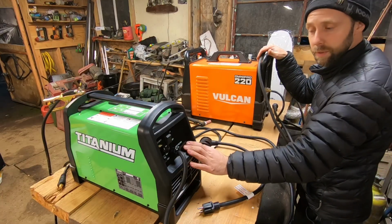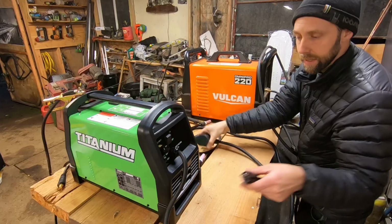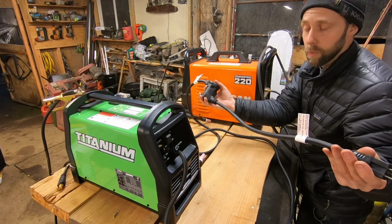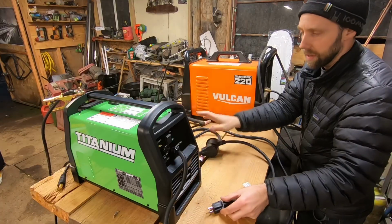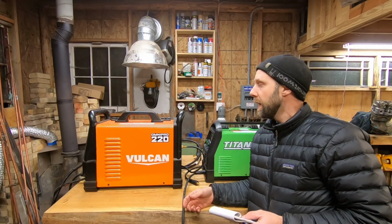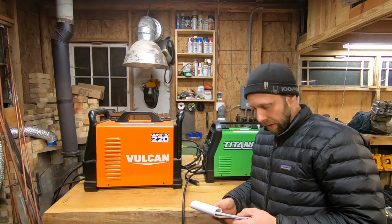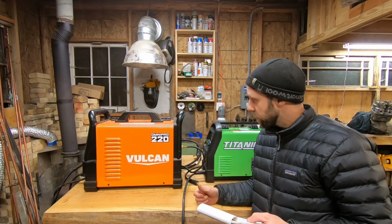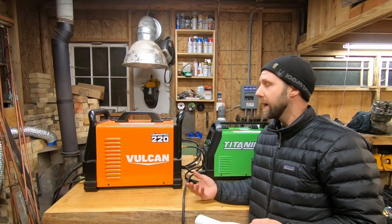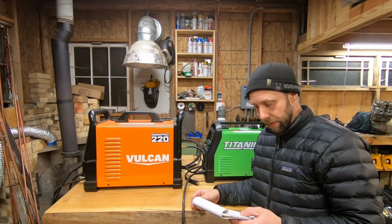So the 10-foot cord came with the Vulcan. This guy's, however, is a little different. This one came with a 9-foot 220 cord and a 2-foot extension to go to 110. So on 110 you get 11 feet, on 220 you get 9 feet. Now I did see a few YouTube videos, some comments people made, and somebody claimed that these had the same duty cycle, which is definitely not true. That's another reason to make this video, to point out some of the differences on these things. It's helpful for me, so I was wondering, if I went in there today, didn't own this, which one would I pick up? You know, there's a lot of price difference on them.